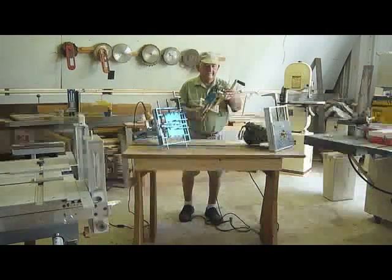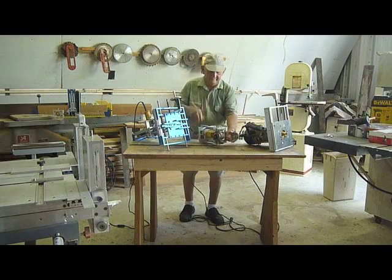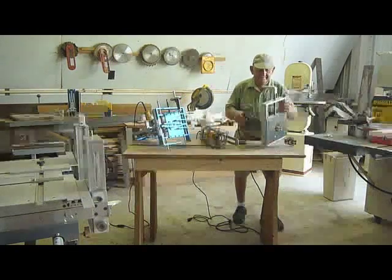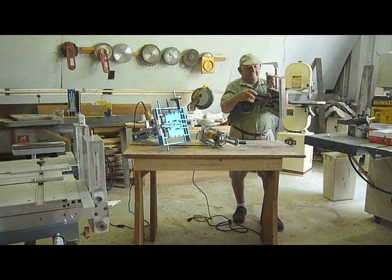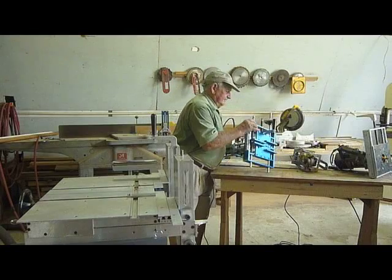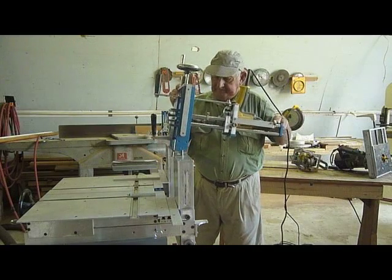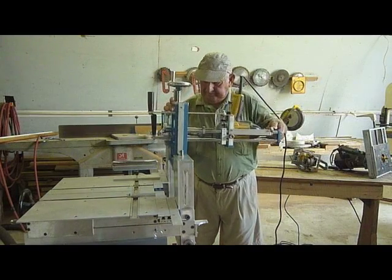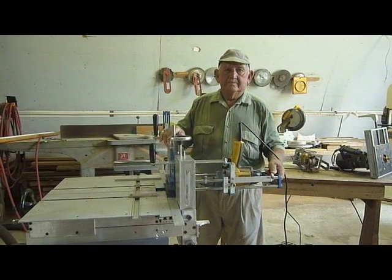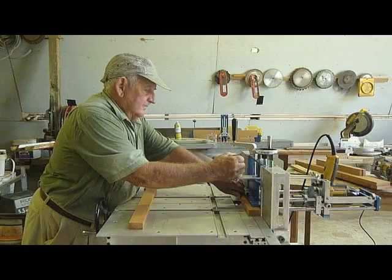It can also be attached to a horizontal drill to make centered holes on materials, as well as a horizontal and vertical router to create tongue and grooves or detailed molding. The jig will first be secured to a horizontal drill and mounted onto a rotatable platform, which has a support mount to hold the tool in place. These elements together offer simple repeatable accuracy and interchangeability in the manufacturing of products.